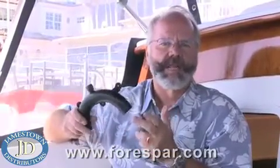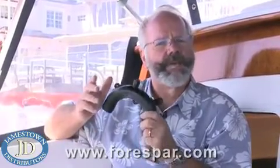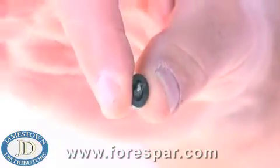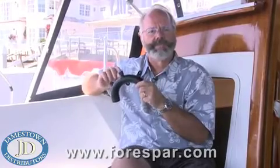First of all, they must be kept clean. Salt buildup or debris can cause them to stay open and allow a squirt of whatever fluid is flowing through them to come out. To clean them, rinse with clean water, or if they're in your waste line, use a little bit of white vinegar. Just be sure that they're closing by carefully looking at the duck bill on the bottom. If you see a deformed bill or a large buildup of waste deposits, replace the cap assembly.